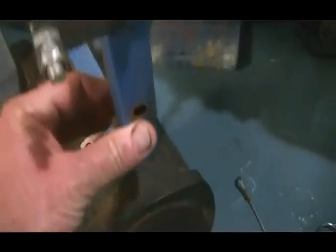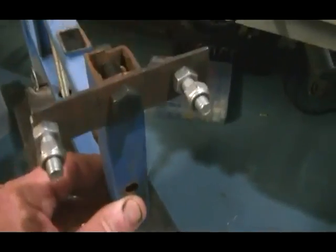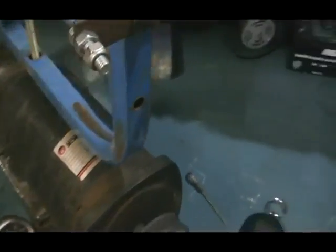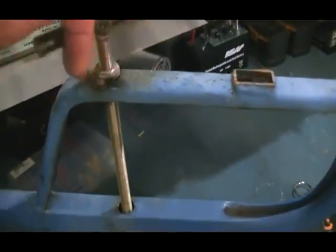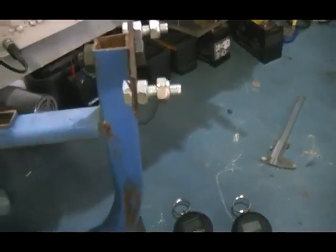Now my lifting device is not going to be hand-operated. It's very hard to keep an accurate tension on the strap when using hands. Mine is actually going to be a mechanical lift setup, and I can adjust the tension simply by screwing this down, which lifts that up.